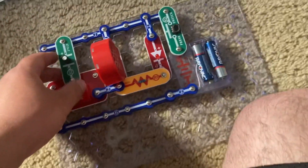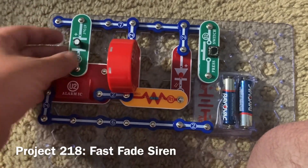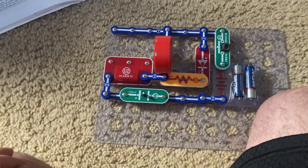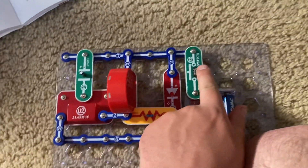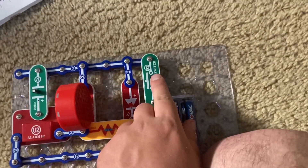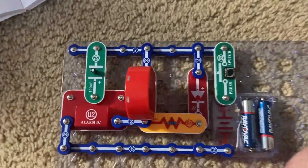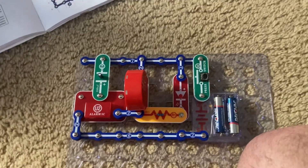For the subsequent variant, Fast Fade Siren, you would replace the C5 capacitor with the C4 one. It charges much faster, so the siren does not last as long. The C4 capacitor holds less energy than the C5 one.